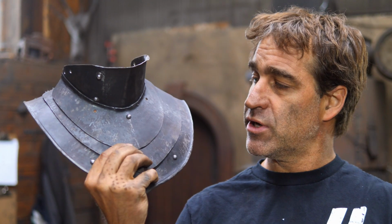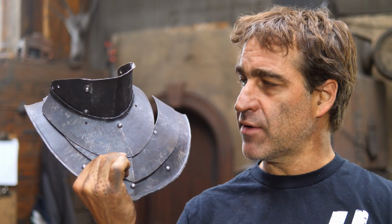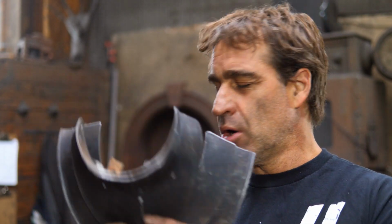All right, so I'm putting these straps on, attaching the straps to this here. And the process, I probably should mention it, I'm taking for granted that it seems pretty self-evident, but maybe not so much. So what I'm using is a 3/16 round head rivet. You might not be able to home in on that very well, but it's a 3/16 rivet and it's 3/8 of an inch long. That's the shaft length there, which tends to work out pretty good for putting a leather strap and a piece of 18 gauge steel together. It's about the right length.